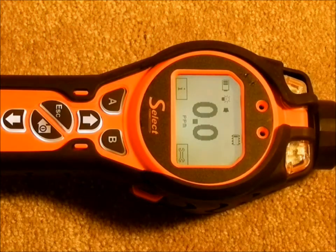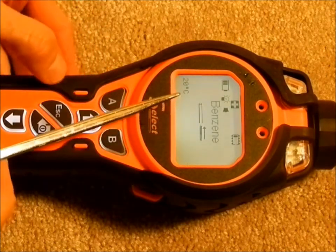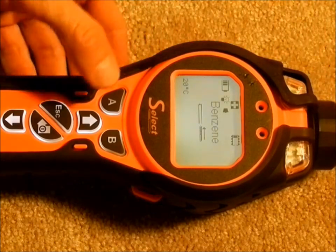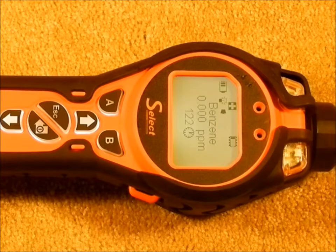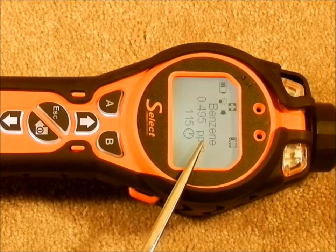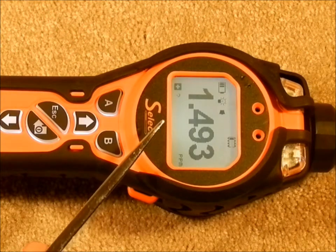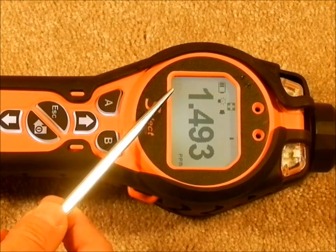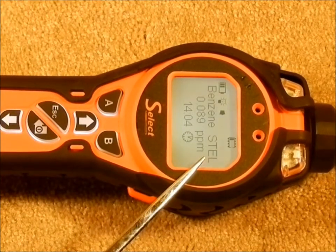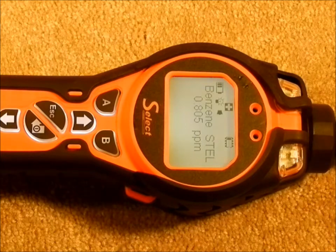To perform a benzene measurement, scroll up to the benzene tube key and push the button. The benzene tube display adjusts the temperature as needed, up or down. Insert the tube and push the enter key. The benzene reading is displayed and the timer counts down. We can now see the benzene concentrations increasing as gas is applied and passes through the tube. At the end of the timing, the concentration is displayed and the unit asks whether you would like to enter the STEL mode by entering the plus key. If so, push the enter key. The benzene STEL reading is initiated and shown continuously, and at the end of the 15-minute period, the STEL reading is displayed.